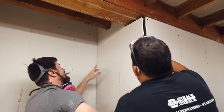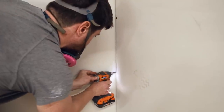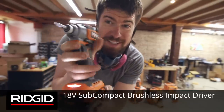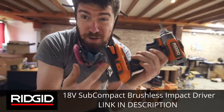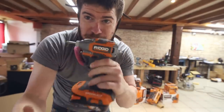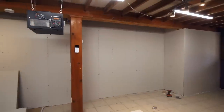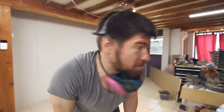Not bad - it fits, it's a little loose, but this is rough framing and that's what joint compound is for. I'm really loving this little Ridgid drill - this thing is so tiny and it's 18 volts. I'll do a comparison on my Instagram stories of how small this is compared to a 12-volt. Definitely digging it - I'll link to it in the description. The only thing left now is to put a second layer of drywall up so that we can meet fire code. I'm not going to bore you all with doing the same thing on camera - we'll do that off camera and be right back.